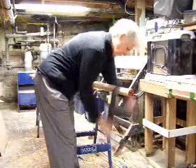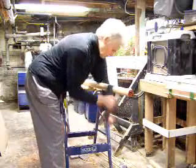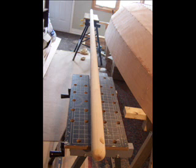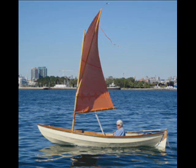Once that's done, you can go over to sandpaper and finish rounding it off — it actually goes quite quickly. I sat down and listened to the radio doing this. At this point, you can finish your mast whichever way you'd like. I made a hole for the halyard and varnished it with countless layers of spar varnish. The final step was putting leather where the various parts would rub against each other. Happy sailing!